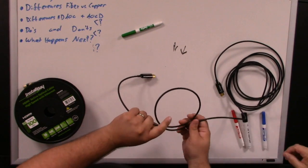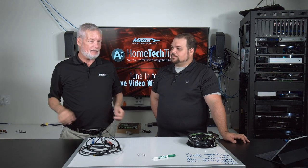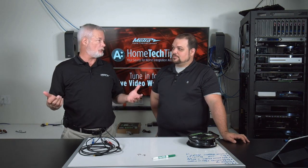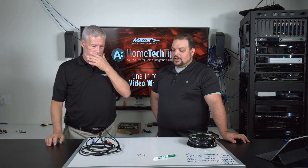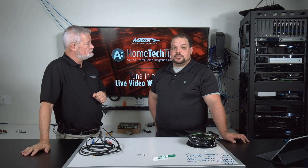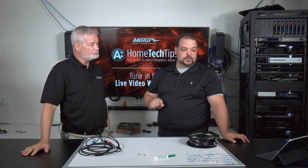The bigger issue we run across is guys pulling it hard around trusses and studs. That's the toughest problem we run into. They run across the attic, they make that bend, and they just keep on trucking. Or they put them in D-rings to go around a hard corner. The metal on those little D-rings is not a good choice. If you do get a snag using the D-rings, you will wind up making a 90-degree turn on that. You really don't want to do that.